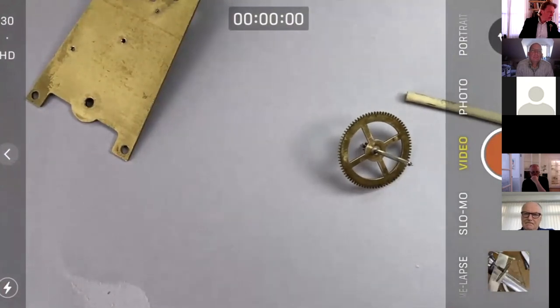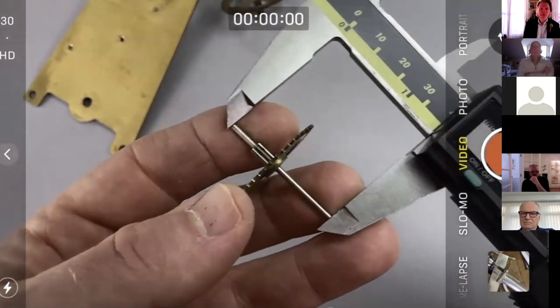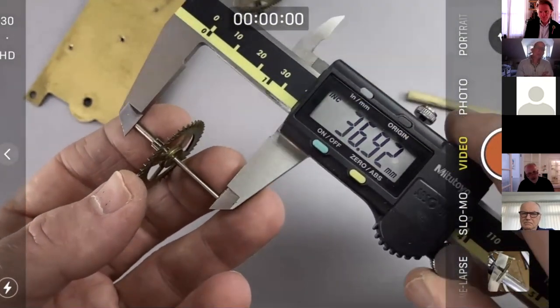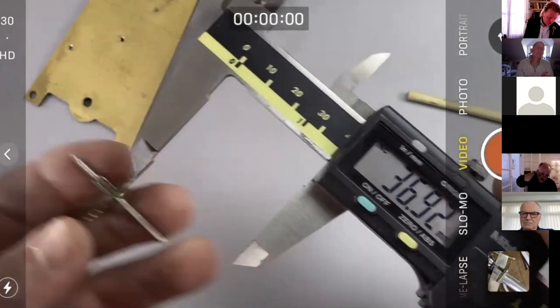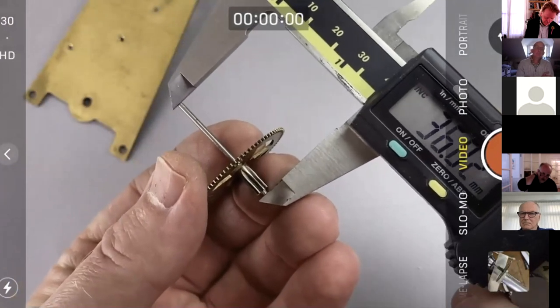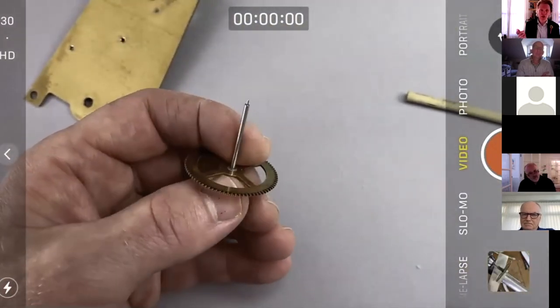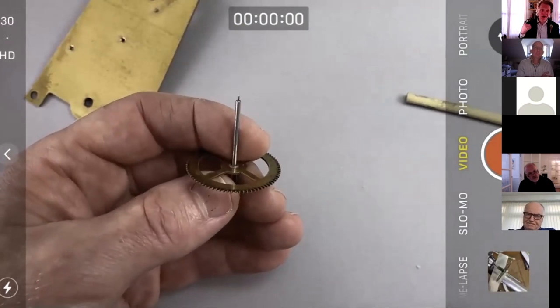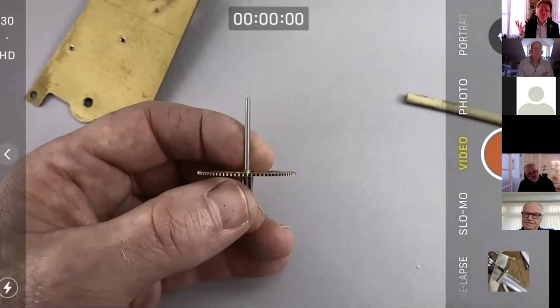So if I can just find another wheel from the clock. There. Let's just have a look at how re-pivoting that arbor has affected end shake. On the basis that they were all the same when they came out of the factory, which of course we don't really know. So that's 36.92. My mental maths is hopeless, as you know. And this one, I've not measured it, so this might be horrific, is 36.82. So given that the arbors were the same length shoulder to shoulder when the clock was new, we don't know, but let's say it was, we've lost, or I've lost 0.1 of a mil through re-pivoting,